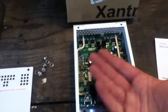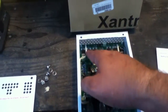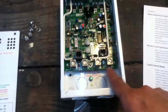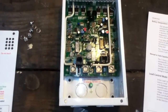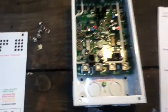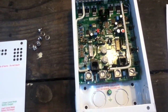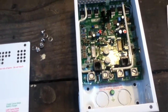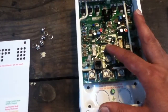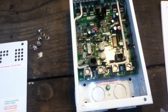We don't really need to know all of the engineering, but flipping the board over you can see some white cables and what appears to be a positive line running up through some diodes — we don't hook anything up to those. Connections are made either via plug or one of these little screw terminals, which look like they can handle up to a six-gauge cable. There are also some configuration settings, including a little dial potentiometer that lets you dial in your on/off voltage ranges and what you feel is the appropriate cutoff.